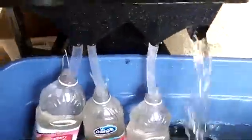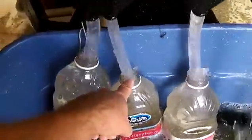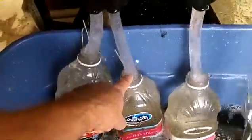The gold will sit in these traps and the tailings will go out this port. This unit has three ports and then your tailings. We've got port one here, which is mainly gold. Then you've got your other one here, which is mainly middlings and heavies, heavy concentrates, iron, stuff like that, and some gold.